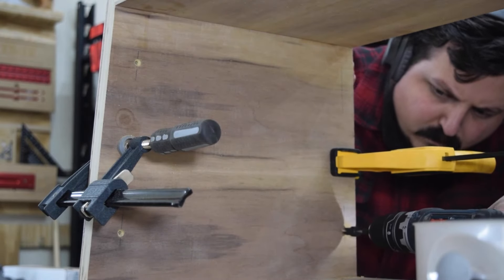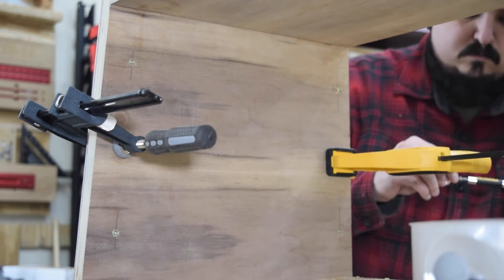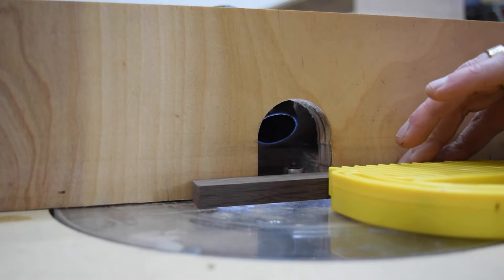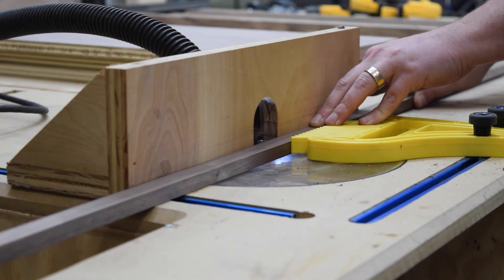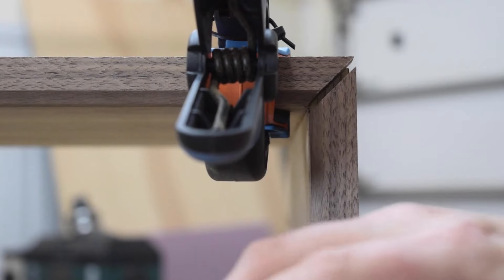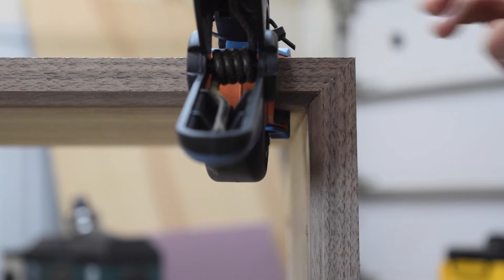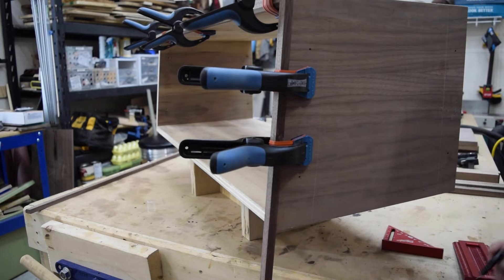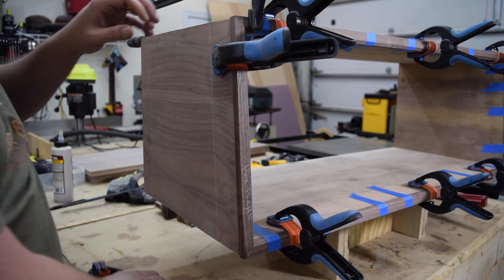To help anchor the legs to the carcass, I pre-drilled and screwed in four screws. These will be removed and then reinserted for the glue-up. I'm doing an inner bevel on the banding for the carcass face, so I ran my strips through a 45-degree chamfer bit at the router table. Then I cut the miters for the edge banding at the table saw using a miter gauge, cutting the strips to fit and working my way around the face frame. Then using some clamps and some blue tape, I glued the pieces to the front of the carcass.